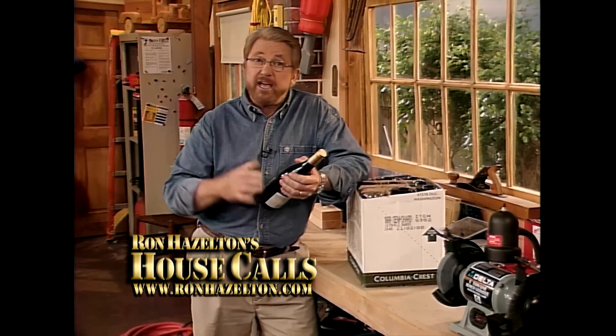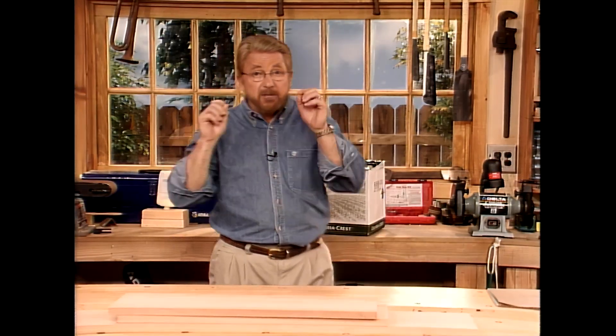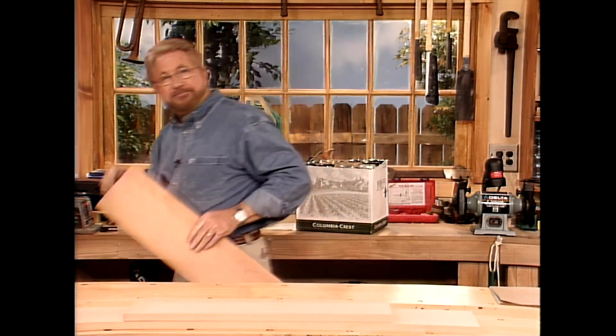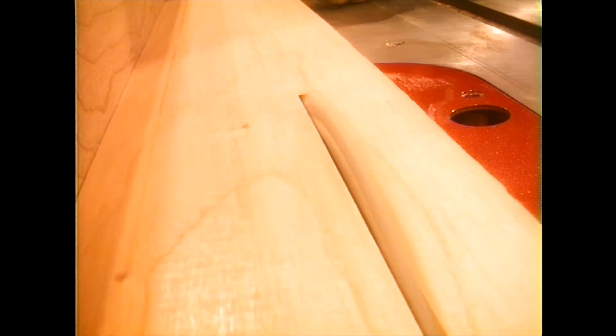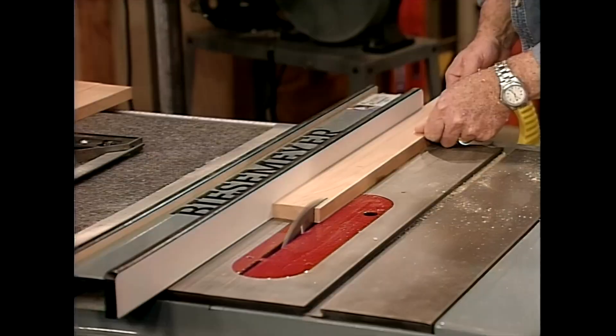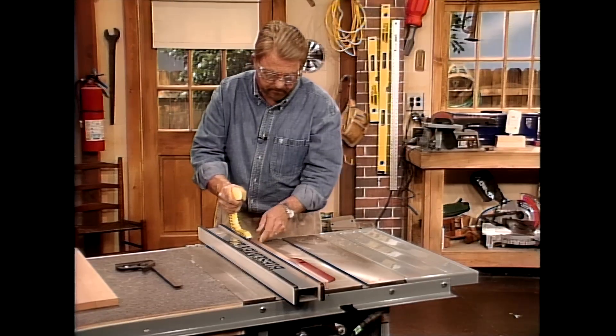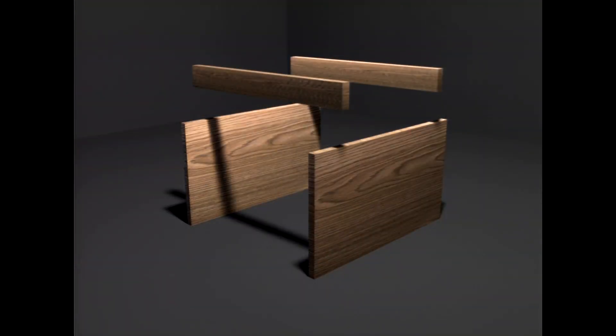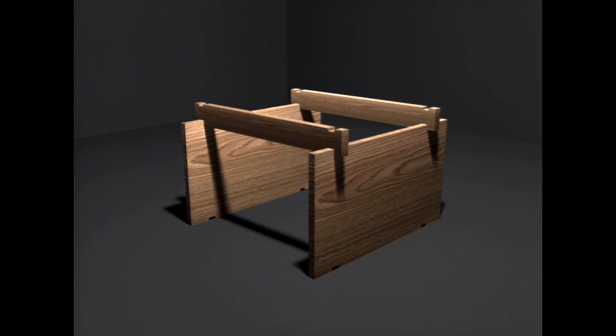Whether you're a wine connoisseur, just like an occasional glass with dinner, or want to learn some new woodworking techniques, you're going to love this next project. We're going to make a wine rack. What I like about this particular design is that it's expandable, modular, simple, and yet quite elegant. We're going to make it out of one of my favorite woods — cherry. I'm cutting several pieces of wood to two basic sizes: 6-inch by 12-inch pieces will serve as end panels, while narrower 3-inch by 24-inch cross rails will hold the bottles themselves. With all the wood cut to size, I'm about to cut several notches or dados — four in each end panel and four in each cross rail. These dados will actually lock the cross rails and end panels together.